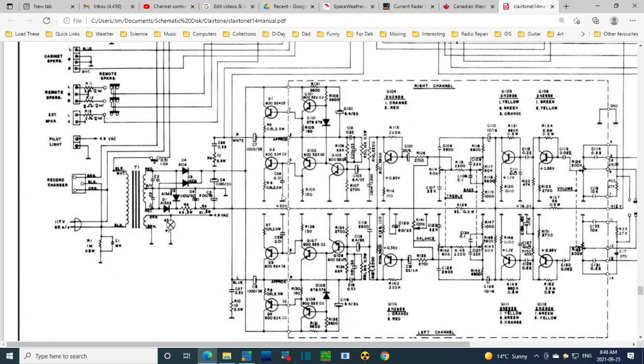20 volts. Did it give the voltage on this? I didn't notice it. I don't see it. Could it be much different? I don't think it can be too much different. So we have a separate, better filtered DC power supply going back further in the amplifier. So you can see it's feeding these earlier amplifier transistors, and back here and back here.